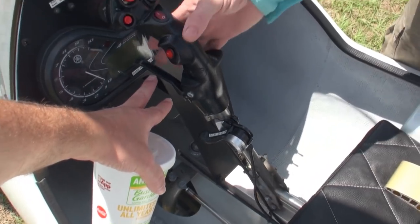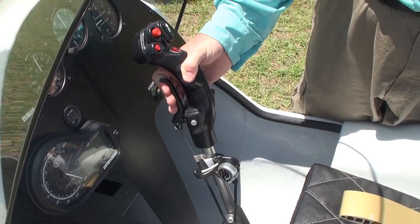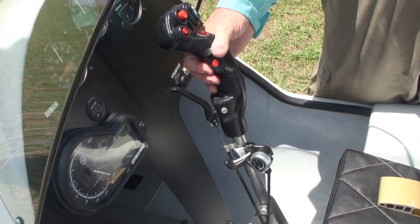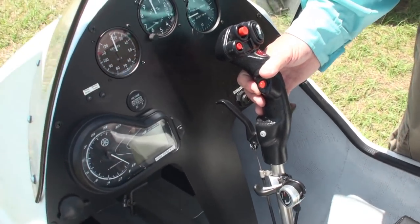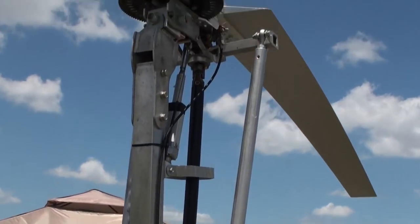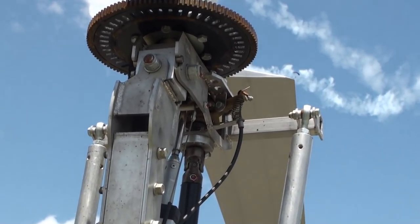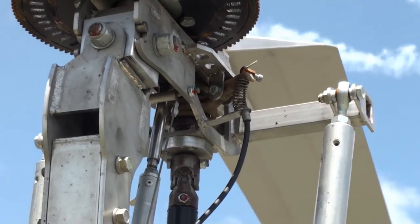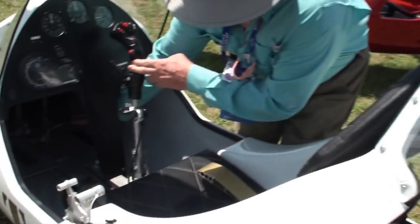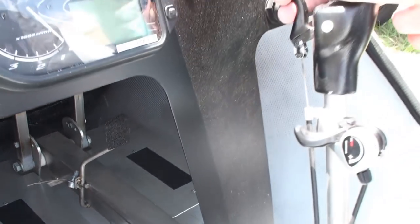This is the manual engagement for the pre-rotator. This lever engages the gear — when it's out of circuit, even if the mechanism begins to spin for some reason, it cannot engage the rotor gear. It uses a Bendix-style engagement of the rotor gear. The second step is a foot pedal which actually engages the mechanism after the rotor gear is engaged.